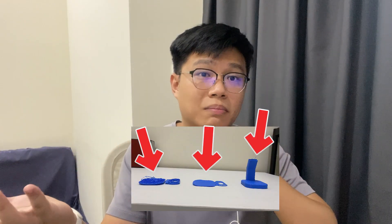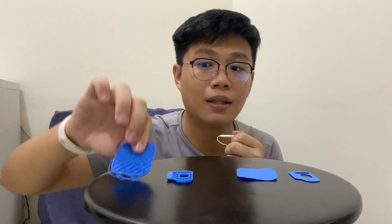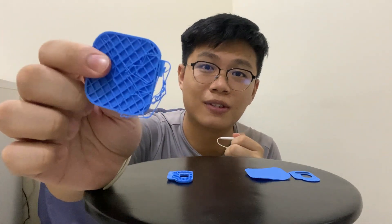Then I failed — three times. The first and second attempts had the same issue: this part doesn't stick to the bed and moves during printing. Luckily, I stopped the process before it started printing spaghetti. I googled a solution and someone suggested that maybe oil fingerprints on the bed plate were the cause. And yeah, I had touched it a lot, so I wiped the surface clean and tried again.